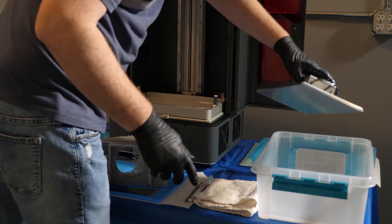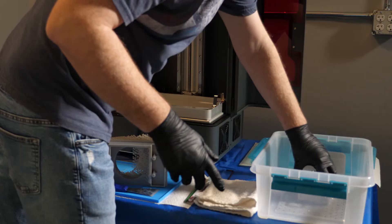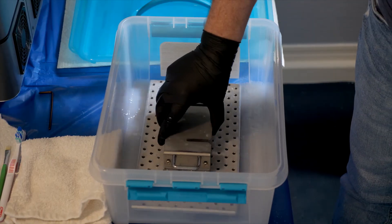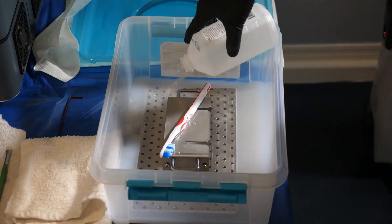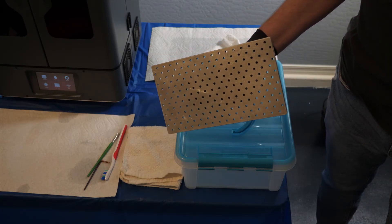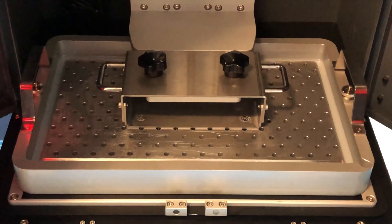With my wet gloves I've now got resin on top of the build plate also, so you don't want to install it back in the printer. Instead set it in the tub of IPA, slosh it around, and let it sit there. Then take off your gloves. Side tip: don't set the build plate in the sun. I tried that after my first print and it was a pain to clean up — the resin cured all over it, some diluted with IPA which still cures, and I had to scrape and scrape for a while. You don't want cured resin on your build plate. Later when I'm ready to print again I pull the build plate out and clean it one more time with the toothbrush, spray or pour a little more IPA to get it really clean, then set it on paper towels to dry. Make sure all the IPA has evaporated and that it's dry before reinstalling it in the printer.